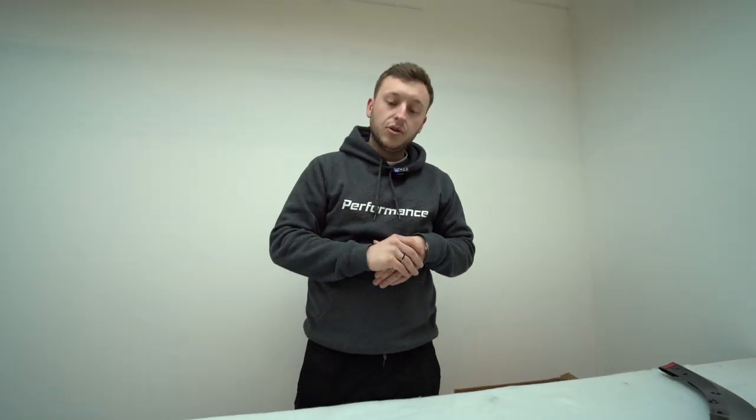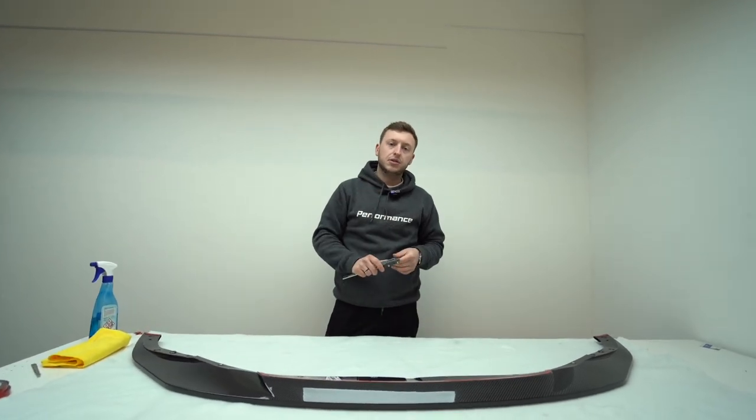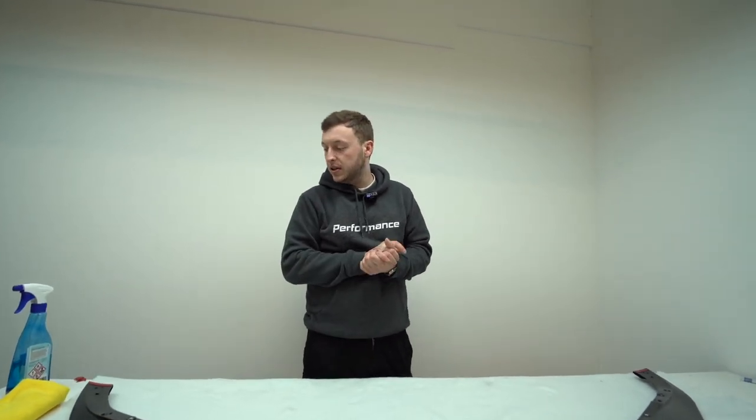And the same kind of process goes through everything. For example, the diffusers, they don't have any 3M tape, so they just get cleaned over. And then we would check some of the clip dimensions, the build up, so make sure they clip in. And we do that every other little batch because we're quite consistent because they come from the type of mold. But if they were manufactured differently, they may differ. But they're normally pretty consistent.